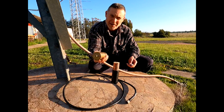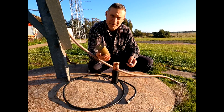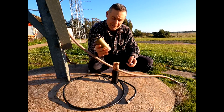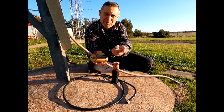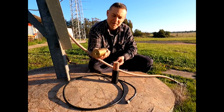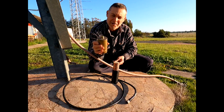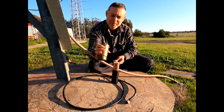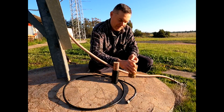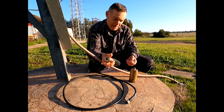This is an Andrew L47 N-connector for LDF 750. This is the outside of it, and this is the center conductor or center pin. It's completely made of brass and it's a real work of art. It's pretty amazing.